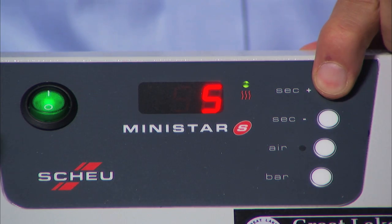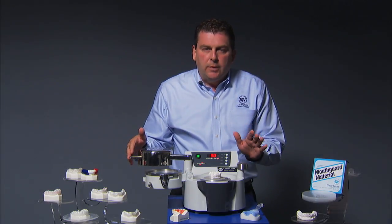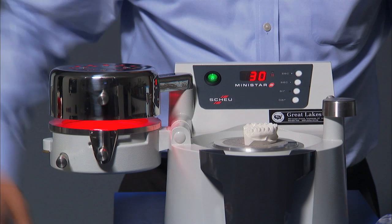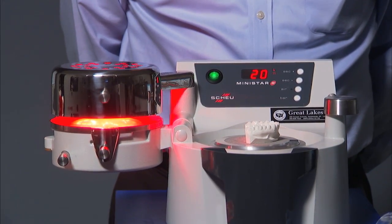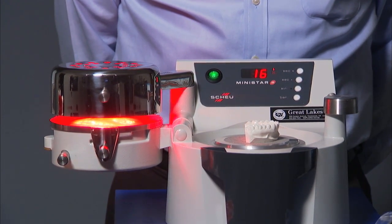The heating times for all of the materials are located on each of the boxes. I'll enter the 30 seconds of recommended heating time. The heating element with the MiniStar will activate in one second, and it reaches its work temperature in the amount of time it takes me to move it from back to front. As soon as the MiniStar begins to heat the material, the timer counts down in seconds. The MiniStar makes it very easy to teach somebody how to use the machine because the heating element is consistent from one machine to the next, so we can tell you exactly how long to heat each material. With a vacuum machine, you're never really sure when the material is heated properly — you're relying on the droop and slump of that material, resulting in inconsistency and rework.